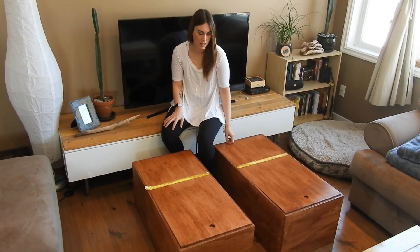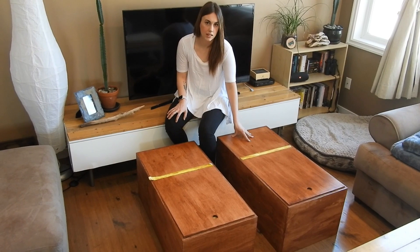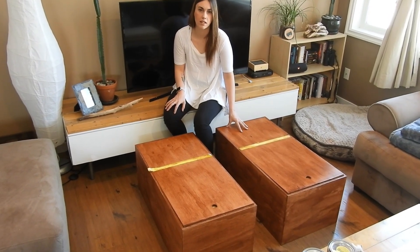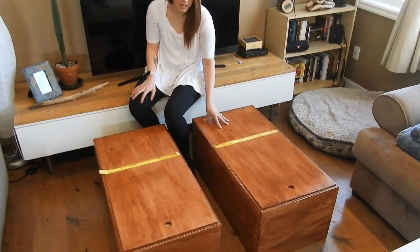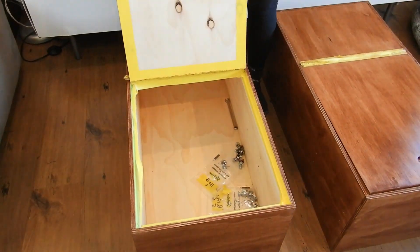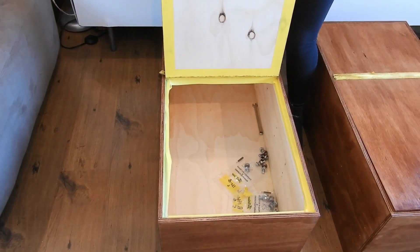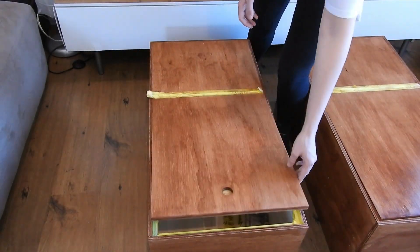This past week we brought our drawers inside, took off all the skateboard bearings, and stained them with a wiping stain - we chose the cedar color. The pop of color in our van is going to be cedar, and then we're doing a pickling white for the rest of the van. We just taped the inside so it's not stained, because it's going to be really hard to get back in there - these are fixed pieces. So we just chose to stain the outside and left the inside rough so anything we put in there won't ding up the finish.